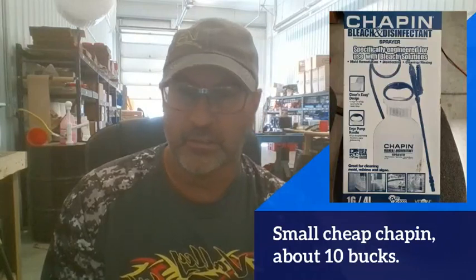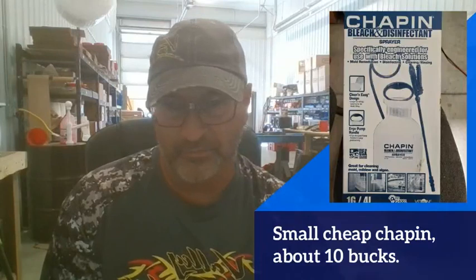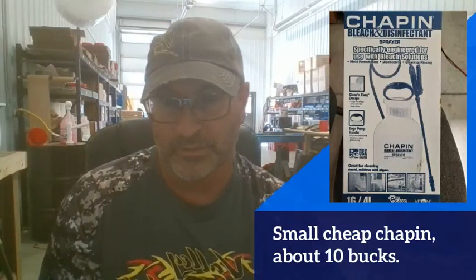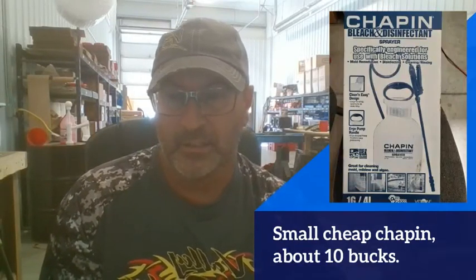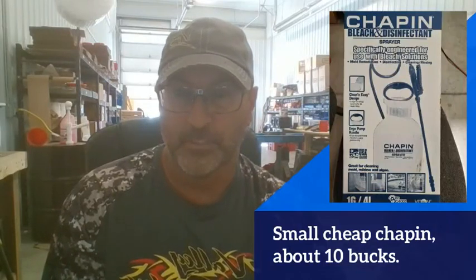If you can take your finger on the curb and there's a little bit of chalky residue left on there, and if you can see that chalk on the curb, typically you can wash that off and it won't be an issue. It's just regular hose and water and a brush. Sometimes even a little bit of vinegar water. It's got a little bit of acid in there, and that'll dissolve some of those calcium salts, because that's a base.